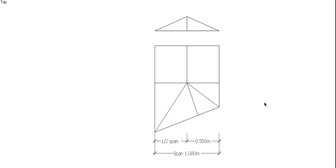I'm going to show you how the bevels were developed geometrically, and then I'll show you how they get transferred onto the steel square. When we work out all our calculations, we base it on a roof that has a half span of 500, or half a meter. Whatever rise or pitch the roof we're working on needs to be, we have to base it on that. This has been redrawn from the one I showed you with the geometric bevels to show those dimensions.